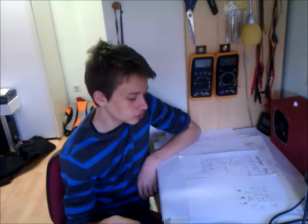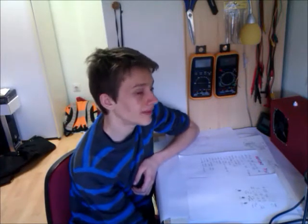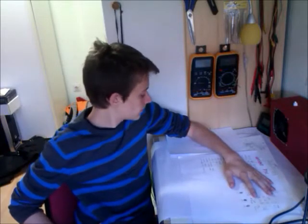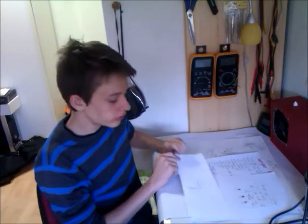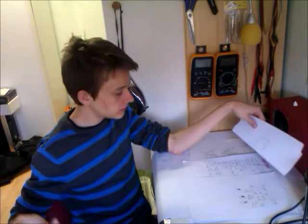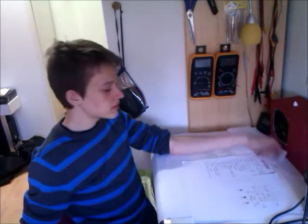There is one quite awesome thing I also added. This will be supplied for big devices and high current. I've implanted a switchable shunt resistor. How current measurement works is it works by adding a small resistor before the load and measuring the voltage across it, as I've drawn there. This is basically the current measuring method — you can't measure current any other way, actually. That's what happens in your multimeters.